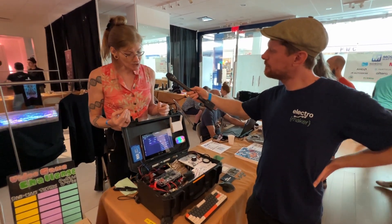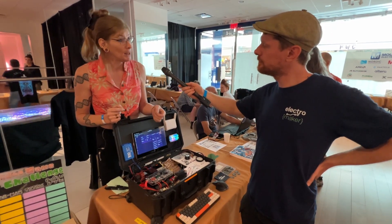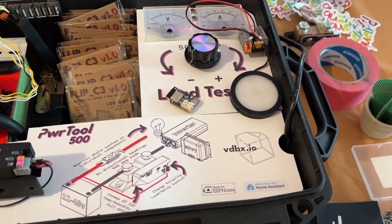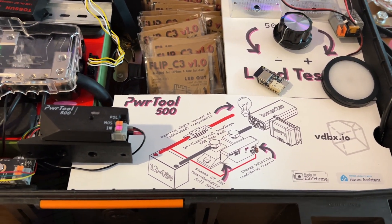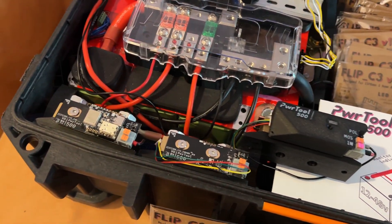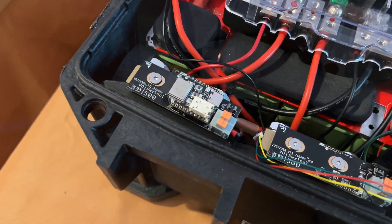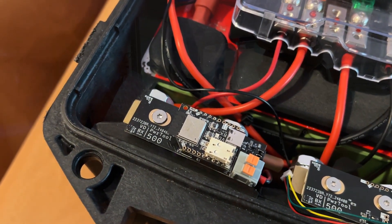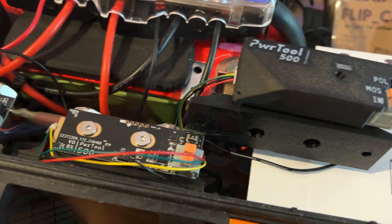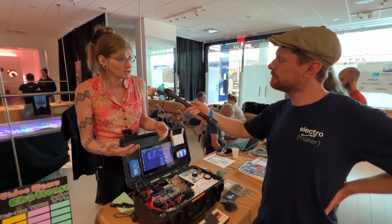One of the main things about the Power Tool is that most power shunts — the Power Tool itself is a play on existing products already out there — but most of those products only work on the negative side of a system, or the cold side, as we call it in the solar crew. But I've actually made a system where you can change the polarity, so you can actually run it on the hot side. If interjecting your ground path just won't work for you, you can also do it on the hot side. So a lot of features for people who want to use Home Assistant in an off-grid or battery-powered setup.